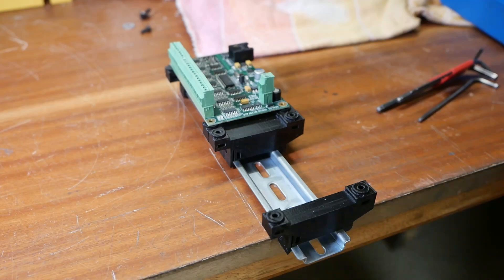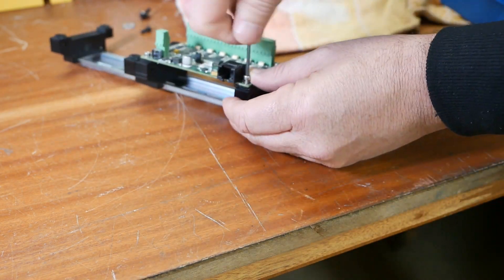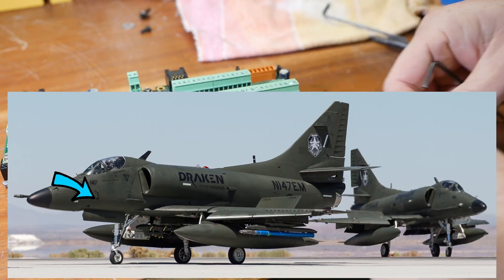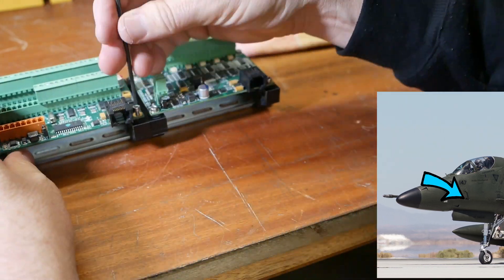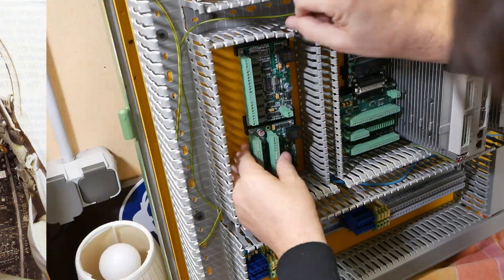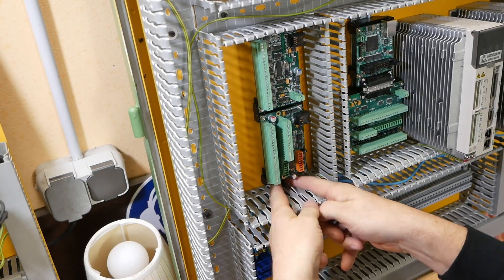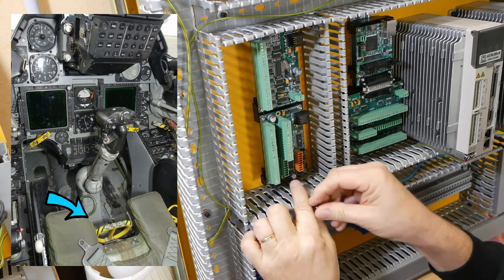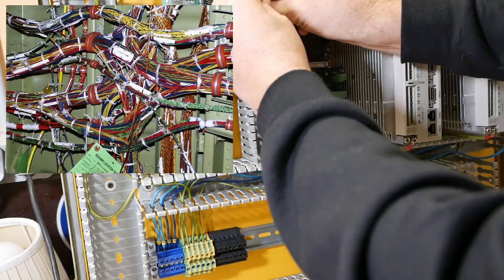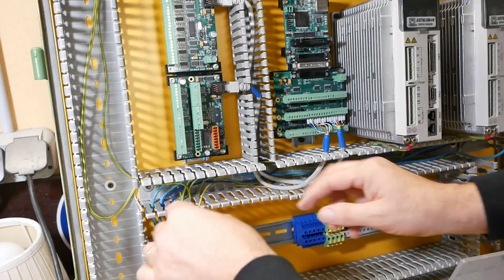Wiring reminds me of my very first real maintenance job on Number 75 Squadron after completing my aircraft mechanics training. Aircraft are pressurized by blowing compressed air into the cabin and then controlling the rate at which it can escape — that is done by the outflow valve. On the A4 Skyhawk the outflow valve is next to the pilot's left hand ankle. My task was to replace it, and as you can imagine even with the ejector seat removed it is a very cramped head-down-ass-up job with your shoulder wedged between the side panel structure and the cover over the depleted uranium bob weight at the bottom of the stick. Aircraft have a lot of wiring and it gets bundled together in looms. There was one wire bundle about as big as your forearm right in front of the outflow valve that I had to work around.